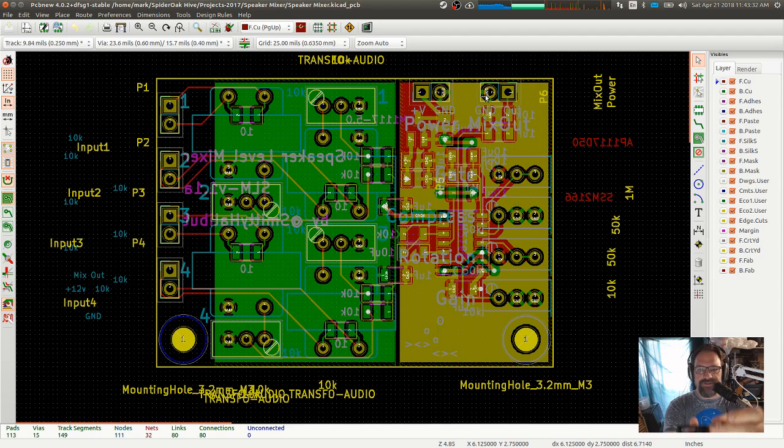For these two connectors, which are just two 2-pin 0.1 inch connectors, those two cables go into these two connectors right here, and I want to keep those in the same place, and I want to keep these holes in the same place. So I'm trying to figure out how to load. I want to get rid of everything else and then reload the net list.